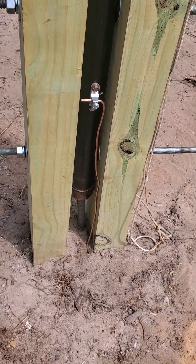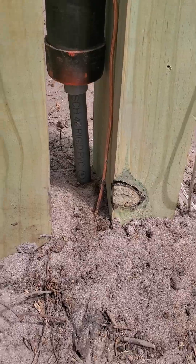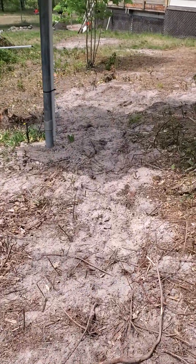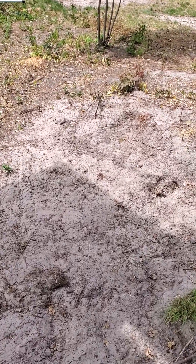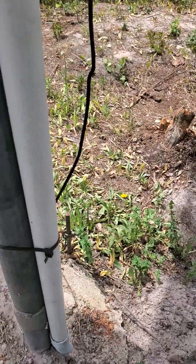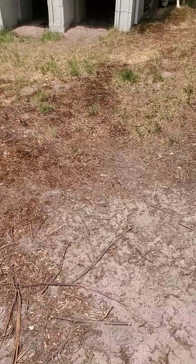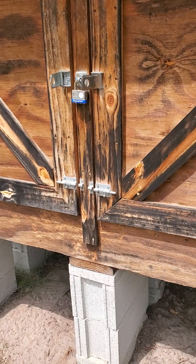Here is our ground — we've got a lightning rod placed about six feet out. If you look down here, we actually ran the wires through this PVC and buried it all the way to the solar panels. Once we buried it to the solar panels, we just teed into the solar panel wiring that was already set up and going into the ground. We connected it all the way in here so we could get it to the battery house.